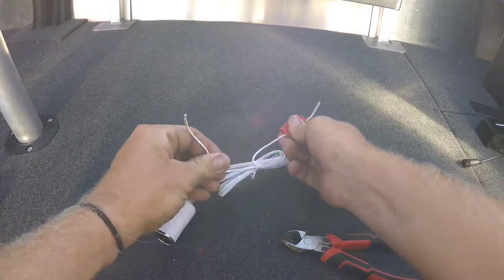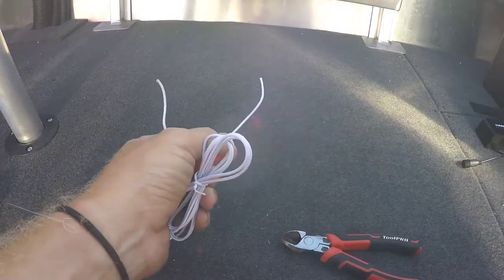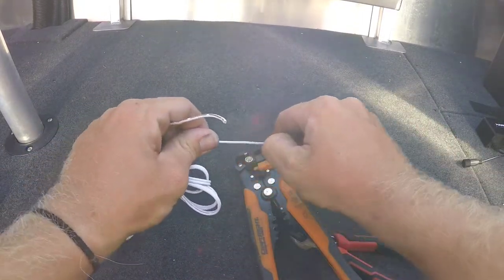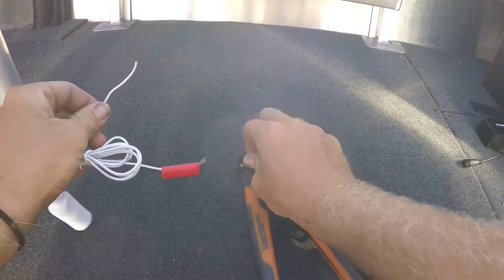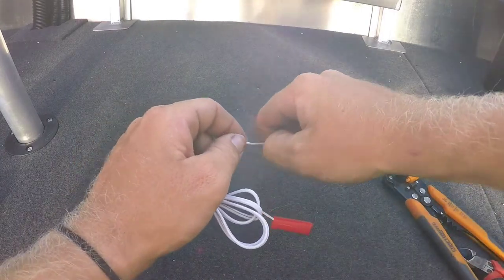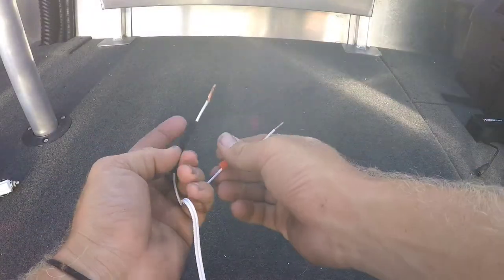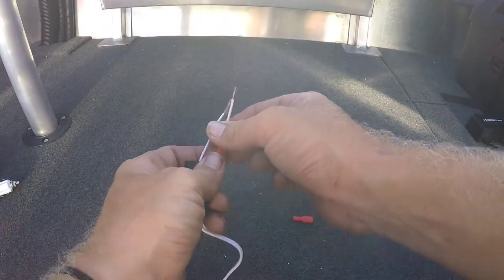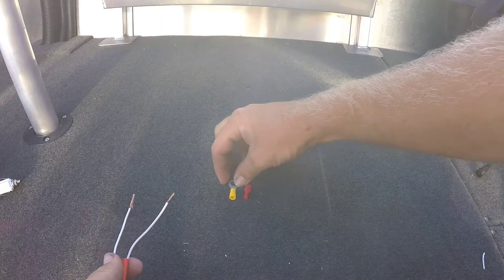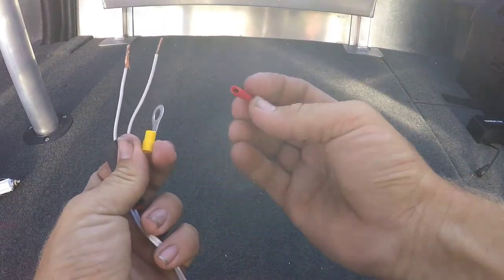Make sure you remember which side's which — this thing comes in handy, so try and keep that on there if you can. Get your strippers and strip the wire — just like that. You're going to want to get your heat shrink on there first before you put any of your connectors on. What I'm using today are these two little guys: this one's just for my earth to go under one of the bolts on the hull, and a little connector to go on the back of my switch. Get that one on there.